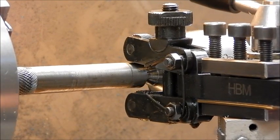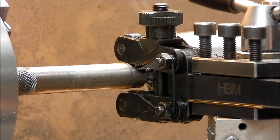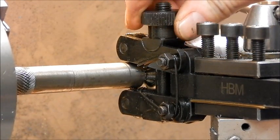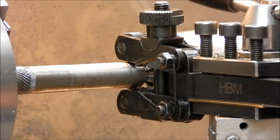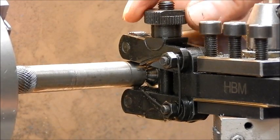Then they do their knurling — put it into feed and feed across. That's how they do it. I was taught differently. I was taught to basically bring the knurl in to centre, get it on the centre position where the rollers engage to the centre point, then screw the knob down finger tight. Then you move it in and out until you're sure both rollers are engaging.